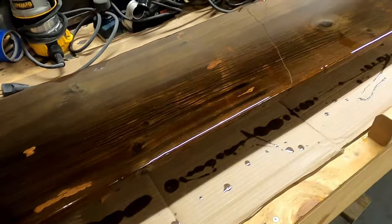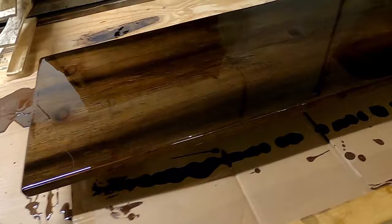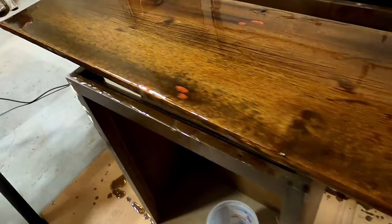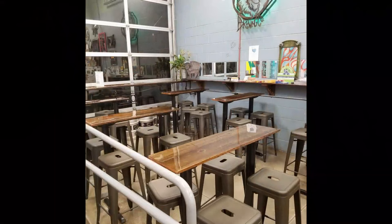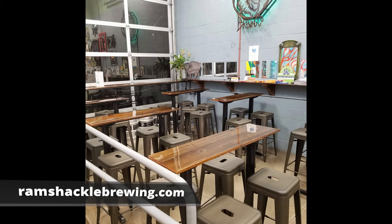Here's a final look at the finished project — everything is still wet at this point, but you can see that things have leveled out pretty well. We're not trying to get to a total glass-like finish. If I was, I would simply aggressively sand this and do one more flood coat and we'd have a perfect glass-like finish — but that's not what the customer wanted. I think it ended up fitting in perfectly with their theme. You can use this process for any kind of uneven surface, not just barnwood. Here's a look at those tabletops in their final stage at Ramshackle Brewery in Jonesville, Michigan. If you found this video helpful, please give it a thumbs up, check out some other videos, and visit northernridgedesigns.com. Find us on Facebook and Instagram, and don't forget to hit subscribe.